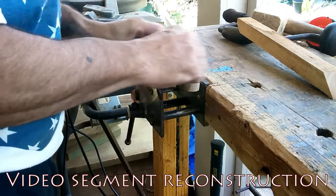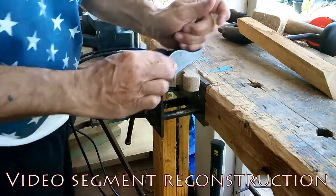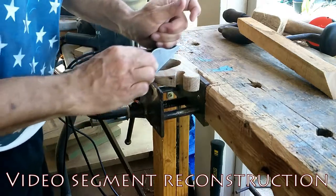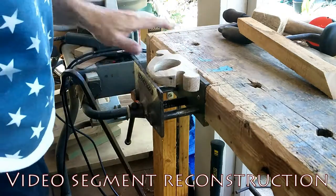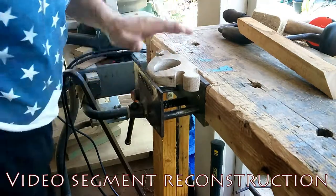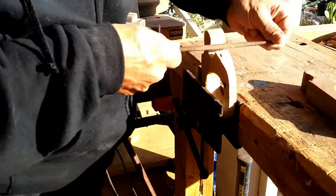I had recorded video of this process before, but the little camera I was using I had zoomed in all the way without knowing it, and so it looked worse than an eight-millimeter movie. So I had to reconstruct this section. It happened that I needed to refine the bevel on that pallet wood plane a little bit better — it's supposed to be 13 millimeters at the front and 25 at the back. So I kept working it until I got a nice smooth curve down to 13 millimeters all the way around.